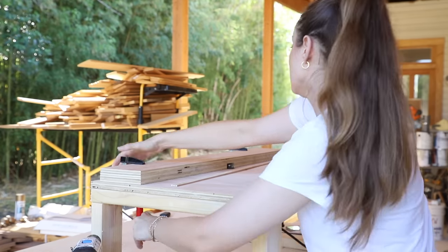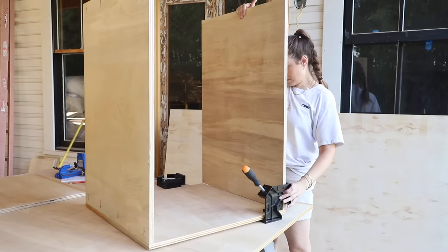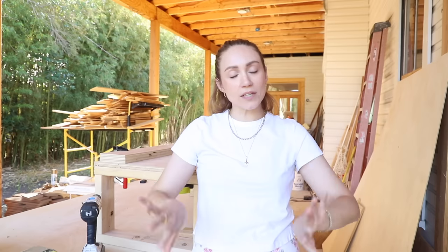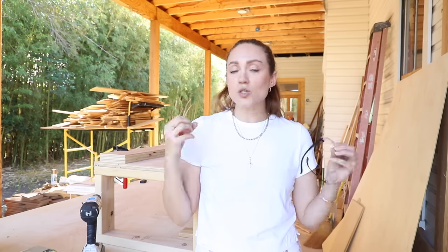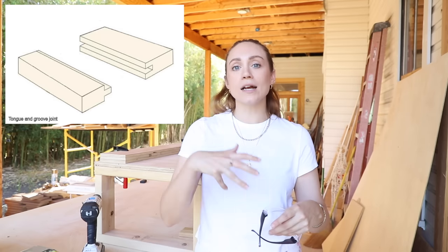I've thought a lot about how I was going to construct these cabinet doors. I do a lot of projects joining wood together with pocket holes, but the more I thought about it, you'd have to have the pocket hole somewhere — when you open your cabinets, you would see them on the inside. It just wouldn't give a super clean finish. That's why I started watching that tutorial. I am essentially going to do his process, but with a few changes. We're going to be attempting to do a tongue and groove type situation — a clean look that's just glue and joints over nails and screws.